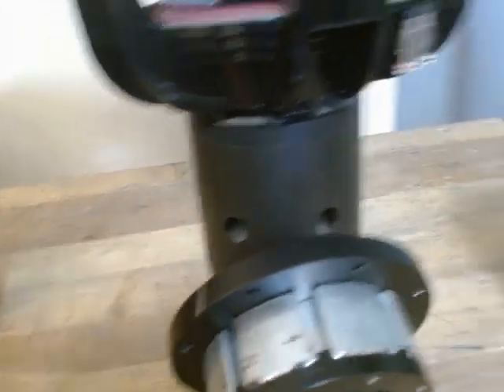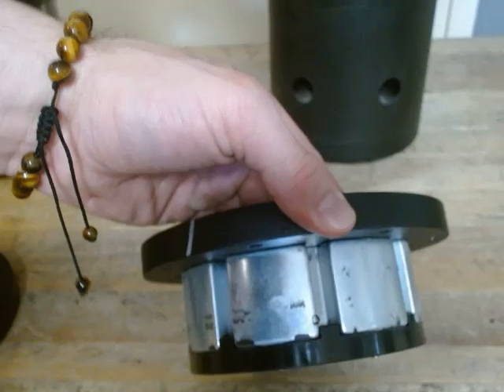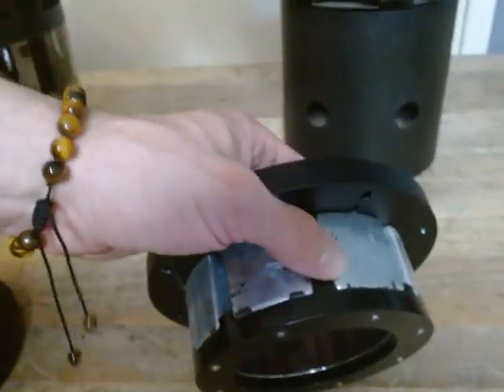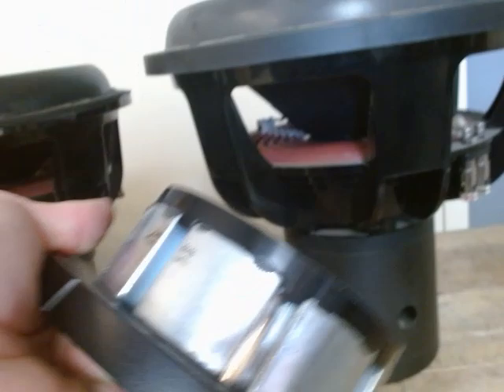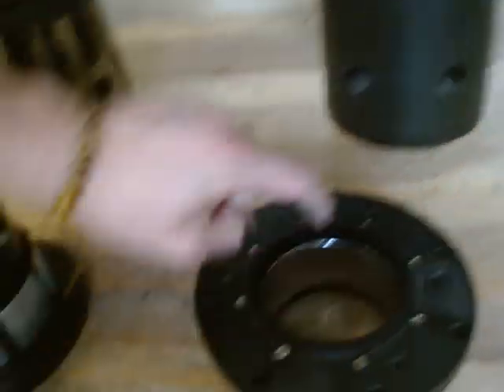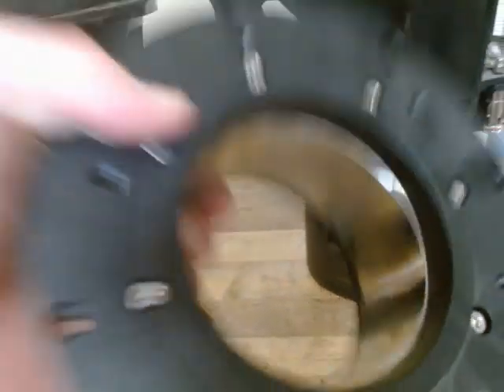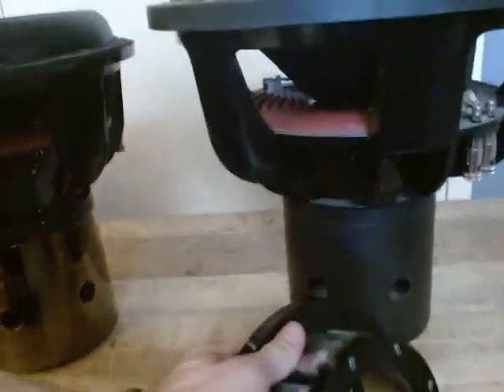The first production of this SAINT technology, as I call it, is the V4. This is kind of like the Tony Stark arc reactor looking thing that goes inside. The magnets actually haven't changed between V4, V5, and V6 — same size and all that. These were N48H and I did upgrade to N52H later, but that's not a huge deal. You can see this thing here is all one piece, it kind of slides down into the motor, and the main novelty on the inside is we have the distribution ring for the magnet flux.